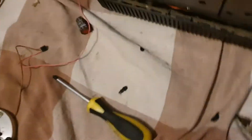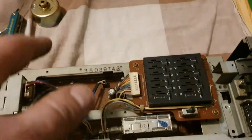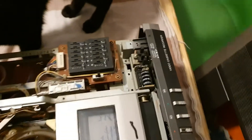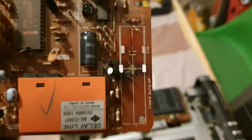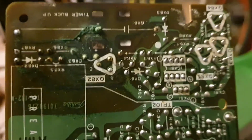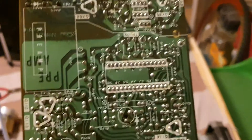The video amplifier is on this board here, which lives underneath the tuner module. This plugs into the front panel through a large multi-connector and a smaller three-pin connector. What's bizarre about this board is it seems to serve two functions — you can see there is a definite line running down the board around this delay line. There used to be a backup battery there for the timer, and as predicted it has done a little bit of damage to the circuit, thankfully on the side which isn't related to the video amp pre-amp section.